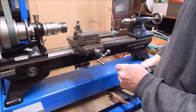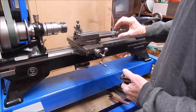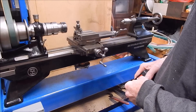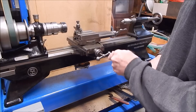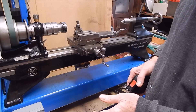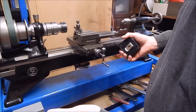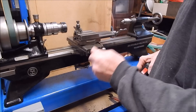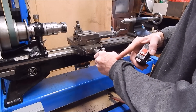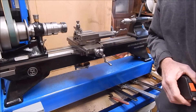So that's it — that's all there is to it. I hope you found it interesting. I was hoping to do some metal casting, but it's coming wet again, so that'll be in my next video. This is an interesting little video for newbies and anybody wanting to build a lathe stand, because there are so many variable factors in lathe size, but the one common denominator is that your working position has to be your forearm parallel to the floor and in line with the cross slide centre. Okay, that's it — see you next time, cheers.